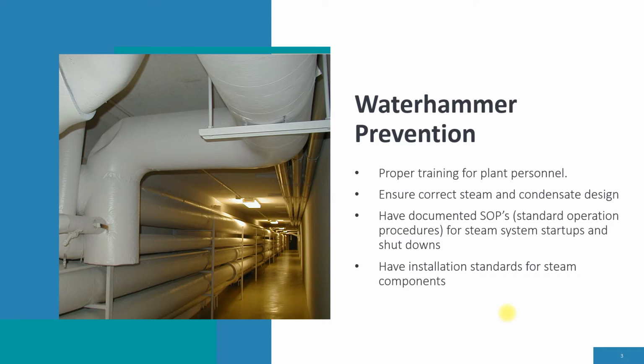You need to have documented SOPs, standard operating procedures, for any steam and condensate line, for startup procedures and shutdown procedures. If anything occurs, the first thing anyone's going to ask you is, where is your SOP?